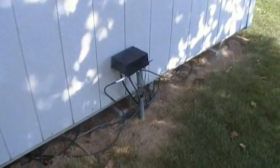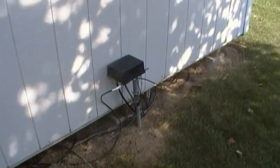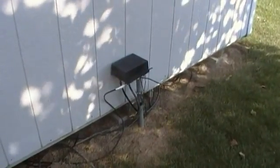It's hard to see but that's the power supply and the MFJ 998 tuner. The inverted L comes in near the top of the shed, goes through ice lightning protection, then to a knife switch, and connects directly into the MFJ 998 tuner. That works very very well on all bands. Going through the side of the shed, it goes up to the top of my neighbor's tree — a total of 165 feet. I switch both antennas: one switch goes to the MFJ 998 tuner for the inverted L which I remote tune, and the other goes to my 40-meter verticals. Thanks for dropping by, hope you enjoy the video, and hope to see you on the band. 73s.